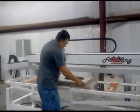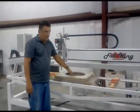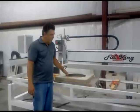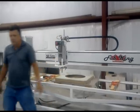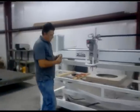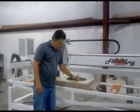The reason for the wood frame is to keep the template above the granite. You have to do that, or if you start cutting a sink, a new diamond will literally eat the template material. The reason being is to keep the diamond template above it.